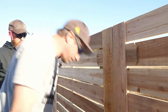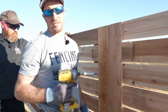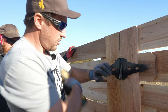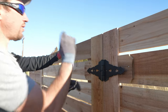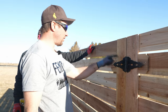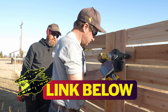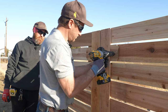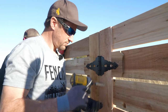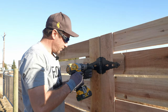We're going to pre-drill the top hinge. We had a discussion about what to do with the middle hole and the post — we'll drill a hole through the post and put a black carriage bolt through that hole into the post. We're in Wyoming and it's really dry, so we pre-drill all our cedar so we don't split it out.